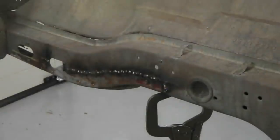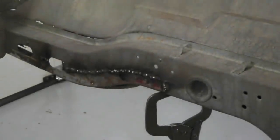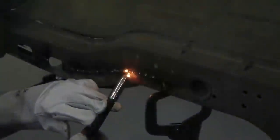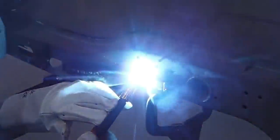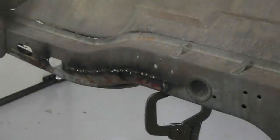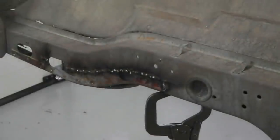Okay, that little area there, see those wire tangs on top of the chassis leg just above the bush mount hole, they're going to need replacing. They're pretty thin. They're the wiring harness fold down tangs that hold your loom in place. Mustn't forget to change them. They're shot, so it's thumbs up because we're done.